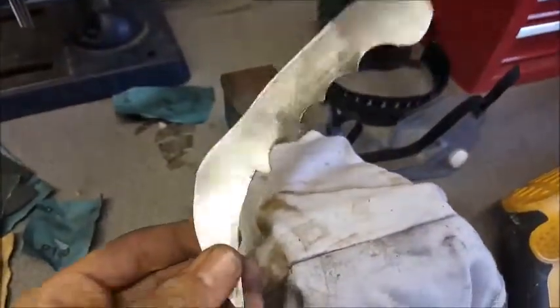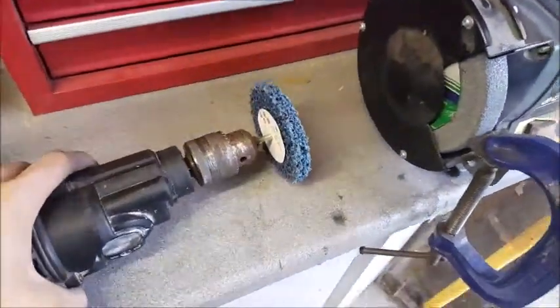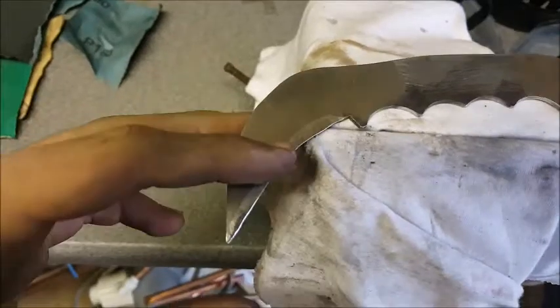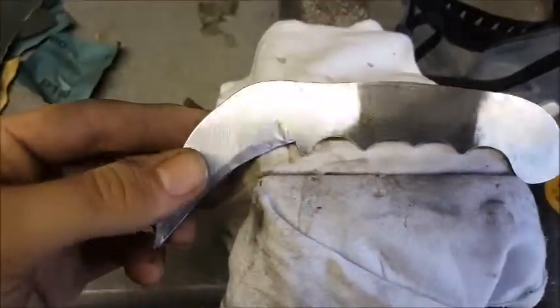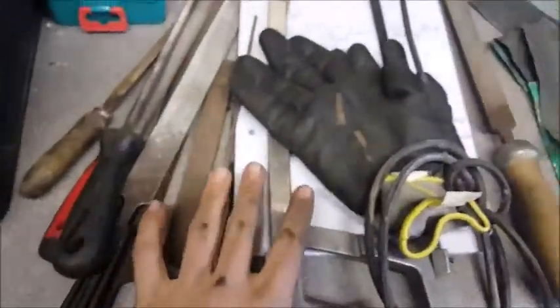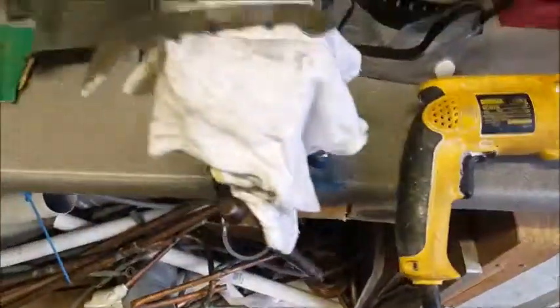It's pretty much finished — it's all polished and nice. I used my buffing wheel and a drill just to really make it shiny. With stainless steel, I'd recommend the grain always flowing towards the blade edge side because that's how stainless steel looks at its best. I haven't bothered polishing the middle because that's going to be covered by the paracord wrap. All I used were files, hacksaws, wet and dry paper, a little sandpaper for getting off the soot from the heat treat, and a grinder. Fairly simple and easy to make.